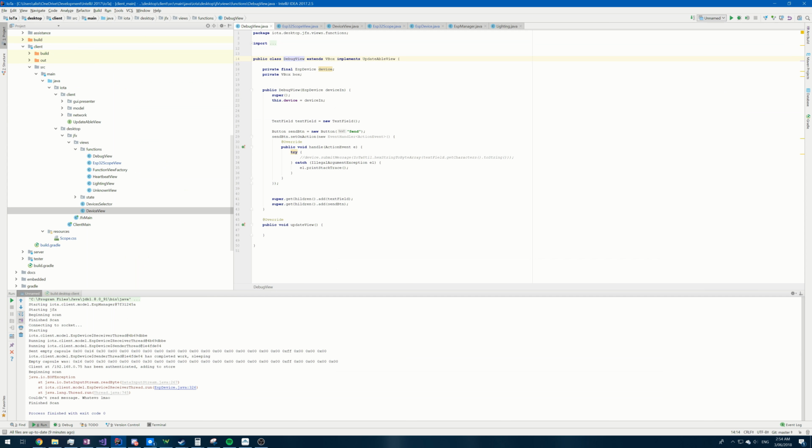So this is an ESP32 based wireless oscilloscope. It's got a pretty rudimentary analog front end consisting of one amplifier up here for small signals, and that's about it. Additionally, right now it's currently using the ESP32's inbuilt analog to digital converter.